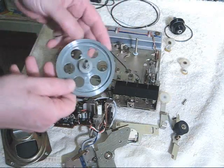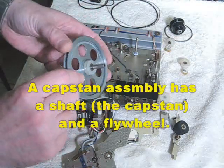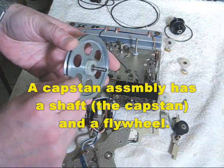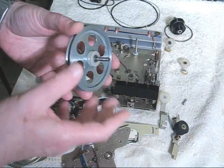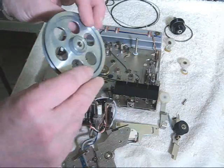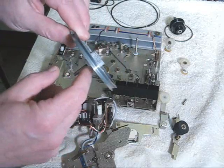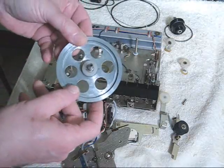This wheel with its shaft is the capstan assembly. Usually they're made of one piece, but sometimes they'll be made of several pieces somehow hooked together, either forged together or with screws, set screws or other means put together. In this case, it is an assembly because it contains pulleys and a geared tooth wheel and a bearing for operation.